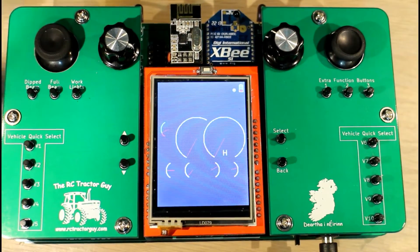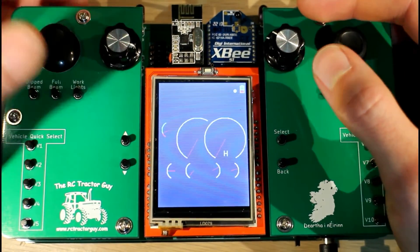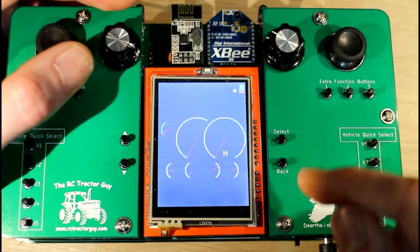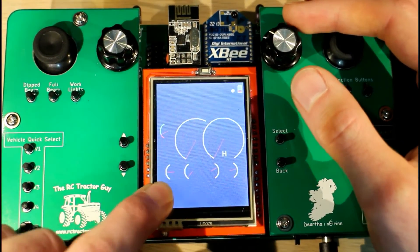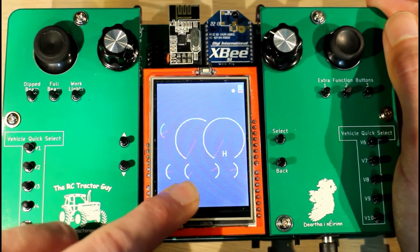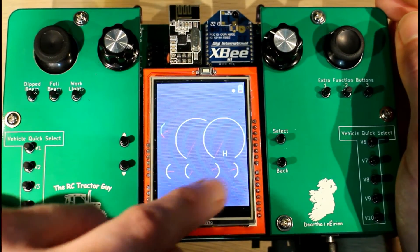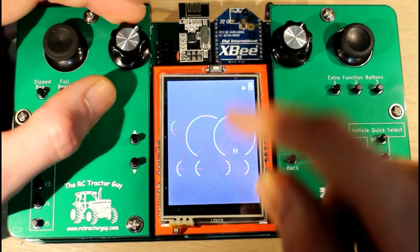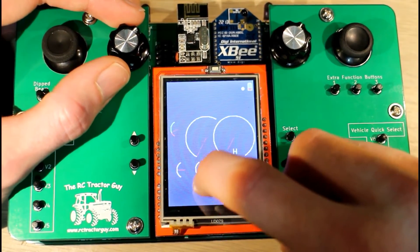The final feature here — you can see these little dials. These four dials are the positions of your encoders. The first one is the front link of your tractor, if you have that on your radio control tractor. The next one is the rear link of the tractor. Then these two are going to control functions on your trailer — so these are like external controls. When you connect your tractor first, this first encoder should control your rear link, which is this second indicator.